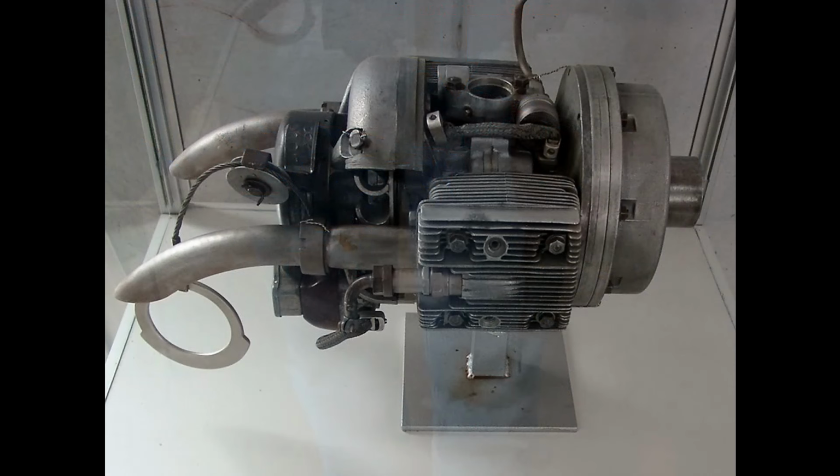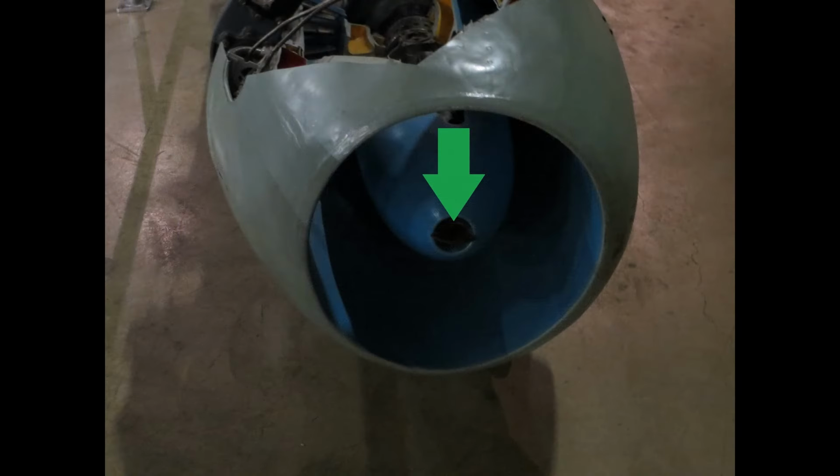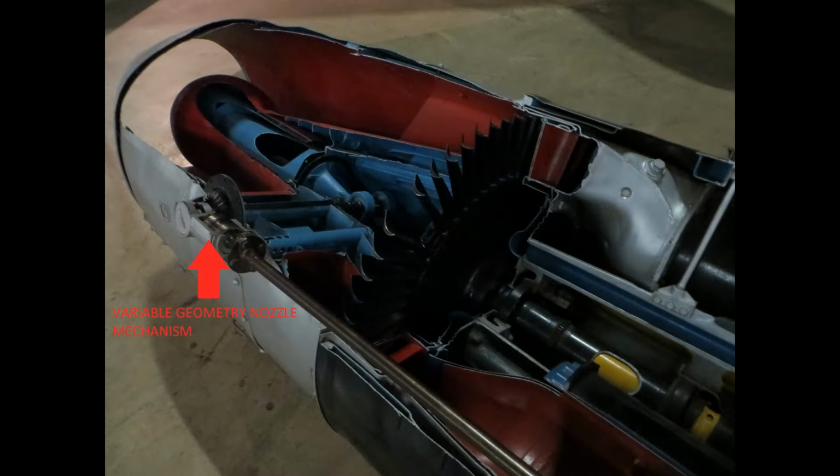It takes it about 1 minute to get the 004 spinning fast enough so you can introduce fuel and ignition and start the thing. Interestingly, the little two-cylinder starter features a pull start handle. It's a D-ring mounted at the center of the air inlet. You can start the starter by pulling this handle, much like starting a lawnmower, and then use that to spin up the engine.